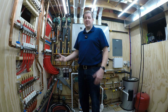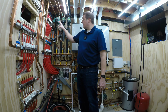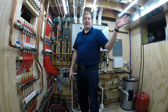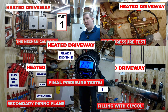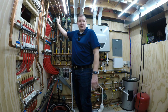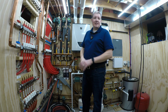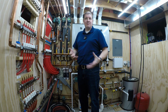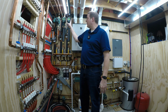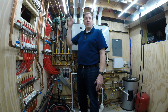That's how it works. There is some minor electricity use with the pumps when the system's on, and I explain this in other videos. I've got a ton of videos on my channel for those of you that are new and want to learn about this, but when the snow melt's on, this pump runs continuous the whole time it's on. It's a big pump. It's a Taco 0013 stainless steel. Probably pulls in 220 watts when it's running. So it's not a light pump like these more efficient Tacos that I use for the radiant in the house.